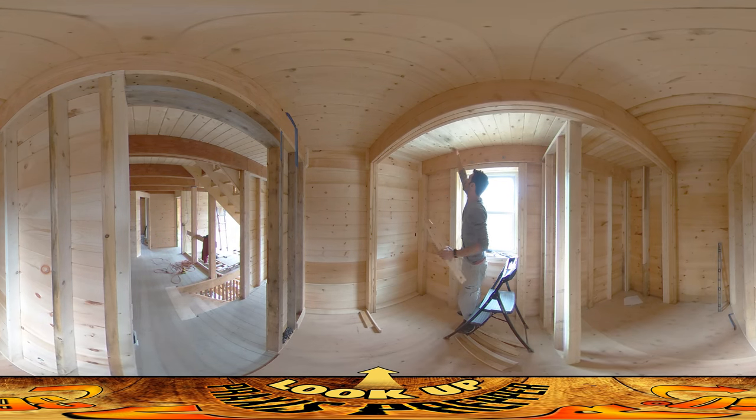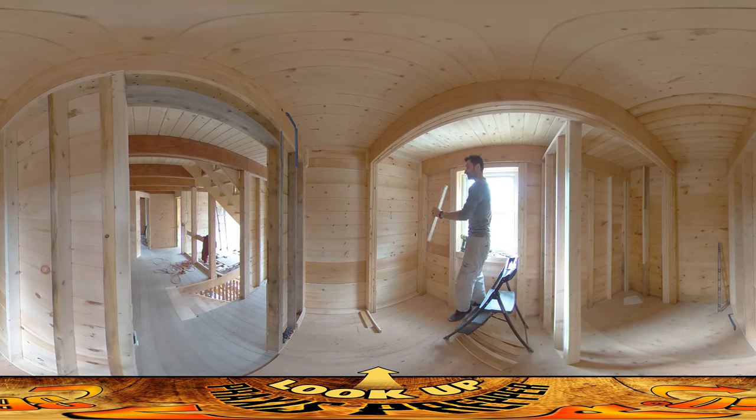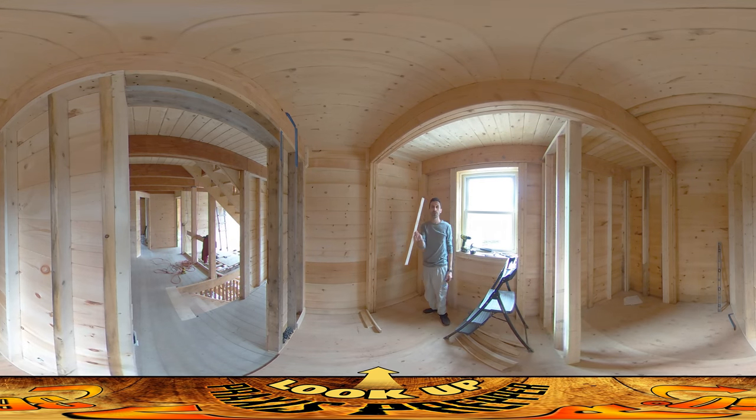What I jumped over to is — there's going to be a drop ceiling here, kind of a fake ceiling below this one, so that all the pipes can run through. I need to be able to nail boards onto something. I've got these pieces of scrap and they're going to be nailed right here, about a little more than three-quarter inches up from the bottom surface, so I can have three-quarter-inch boards on the bottom. These are scrap floorboards — little scrap pieces too short to use for anything else — so I cut them down in half and they'll be great use of scrap.